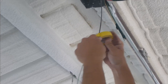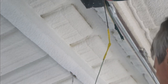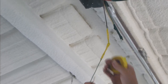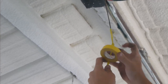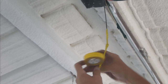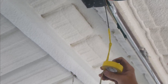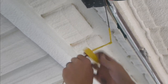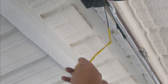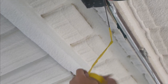This is way under conduit capacity so it's relatively simple. I'm going to pass the ground through there, bend it back tightly. I'm using yellow marker tape, getting a little in black. I don't use a lot of marker tape normally — I did for the lighting circuits down there for the three-way and four-way switches. Hopefully I'm getting enough tape built up around this so it'll pull to the next junction box without me having to go along and assist it. I'm going to bring the white one in there, just behind where the ground stops.